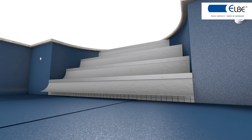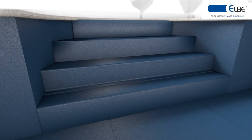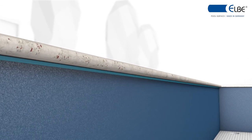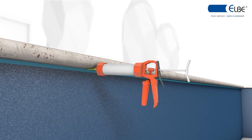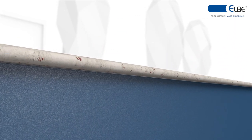Subsequently, the polyester fleece is cut and placed in the required paths. After the swimming pool path is cut, it is reattached using the welding machine after it is perfectly aligned. Then the area between the pool edge stone and the installed pool sheet is sealed with suitable silicone. To protect from dirt, a self-adhesive tape should be applied before sealing the gaps.